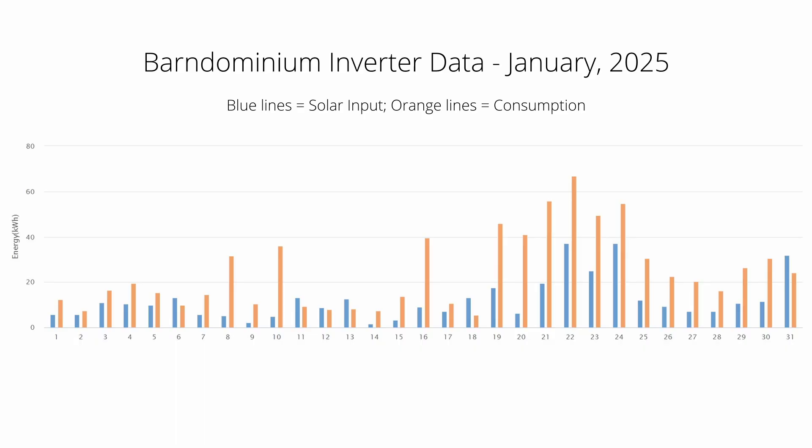Looking at the inverter data, we used about 300 kilowatt hours to heat this whole space. This whole space, counting it as a two-story area, is the equivalent volume of about an 8,000 square foot house. The garage I wasn't that worried about, but I did run the heat in there as well. In the living space, the ceilings are eight feet high and the bedrooms have the one-ton units in them — it was pretty easy to regulate the heat in there. The building itself is insulated with R10 all around, but the living space walls with eight-foot ceilings are separately insulated with R13, giving you effectively R23 in there. No matter what happens, the bedrooms, bathrooms, and living areas will be comfortable year-round very easily.